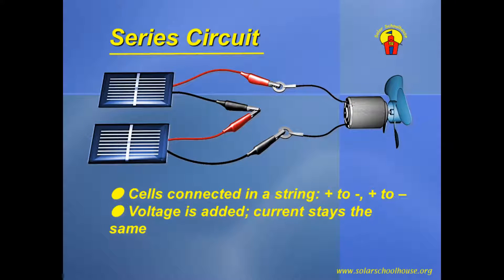This type of wiring is called series wiring, because the batteries are connected in a series, one after another. Here's how this circuit would look with solar cells as the voltage source. By connecting the red wire from one cell to the black wire of the next, the voltage of the two cells is added together. Cells are connected in a series, one after the other, like a string.